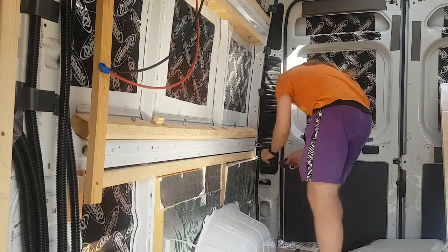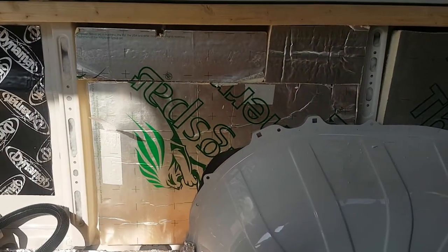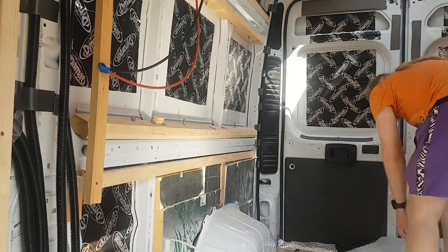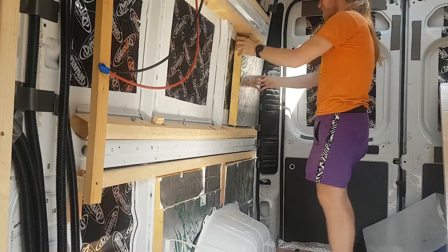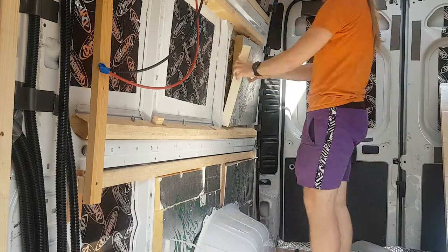I started with the insulation for the wall, using 50mm Kingspan in relatively small segments. I essentially assembled it like a jigsaw puzzle, using what bits I had and some new stuff, trying to be optimal because I didn't really know how much I had relative to how much I needed — I'd calculated and bought it all last summer. I friction-fitted pieces of Kingspan across the entire wall before sticking anything in place.